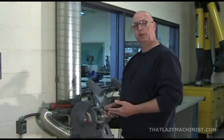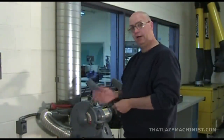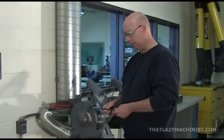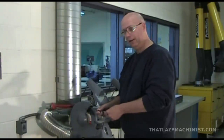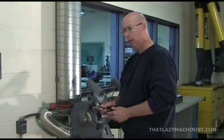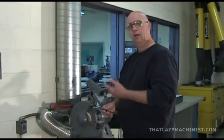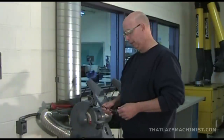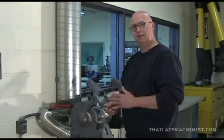So, let's start sharpening. Remember, cutting lips or cutting edges, horizontal. Length of drill, horizontal. 59 degrees offset. We're going to push into the grinding wheel, pivot, without twisting. Very important. Now, it's hard enough to get the angle, the chisel edge, and the back clearance all in one movement. But it's even harder if you flip-flop around from side to side.